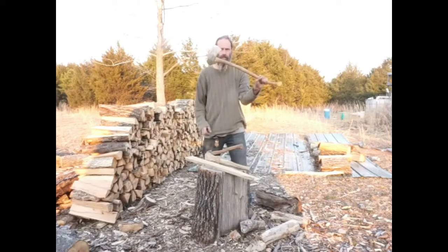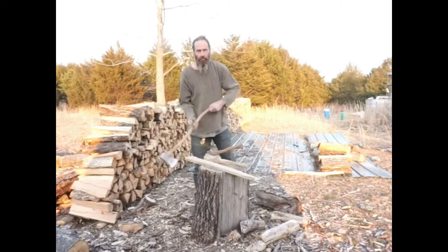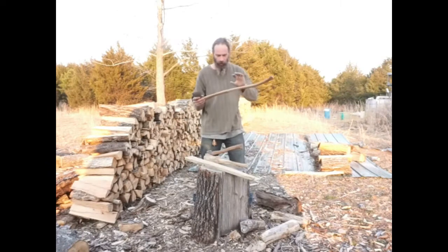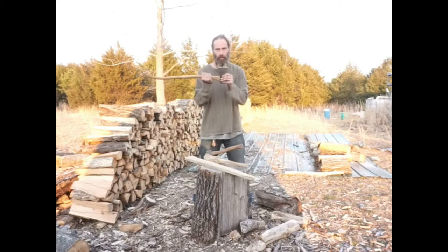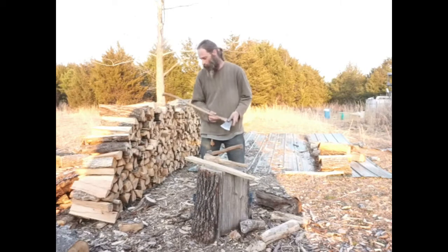So, this axe handle is great. I love it. It's absolutely wonderful. I can't feel hardly anything when I stick this in a piece of wood, and I really love that, and that's due to this low-shock design. The only problem is, this guy's coming loose because this plank wasn't completely dried out when I made this handle, and actually just sticking that into that piece of wood is almost enough to drop the axe head off the haft. So we've got to fix this problem.